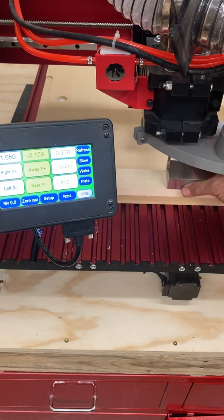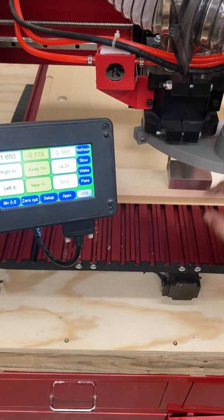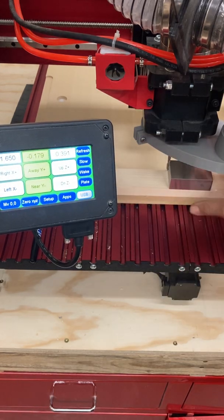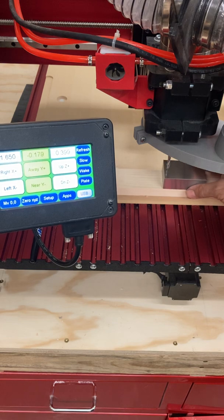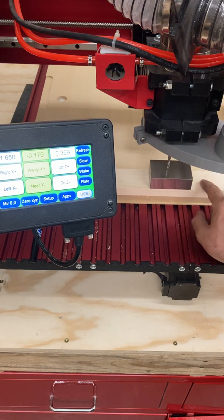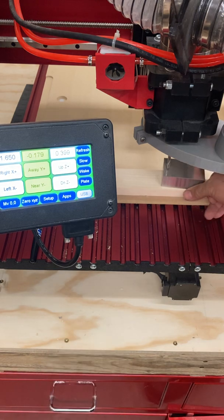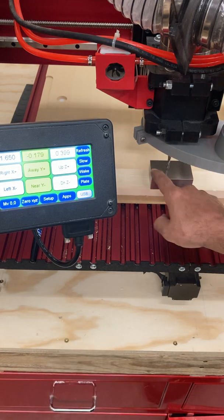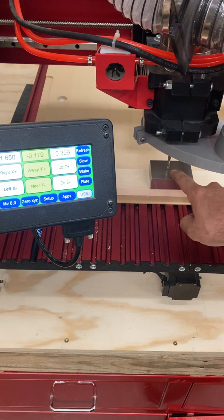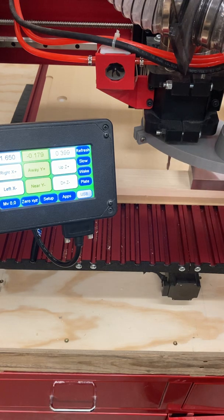What I'm looking for is that one point where it actually slides underneath — that is where I'm going to set my zero. And I'm almost there, probably just a few more of these. Perfect. So this is my Z offset. This cutting tip is effectively exactly one inch above this material. I'm even at the point where I can feel a slight drag on the cutting bit on the top of this, so this is really a perfect zero.